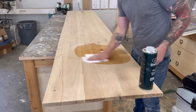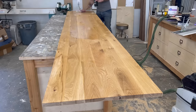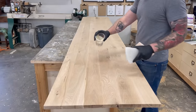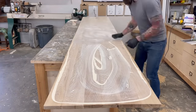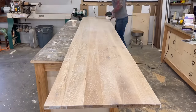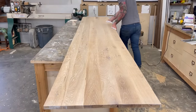With our desktop now cut to the right shape, it was almost time to finish it. First we cleaned off the entire desktop to get rid of any excess dust — Rubio Monocoat does a lot better when you get rid of all the dust, as it allows the finish to stick to the wood. With it all cleaned and dry I started pouring on the finish. I used cotton white — you can't really blame me, cotton white looks so good on white oak. Once you wipe it off it almost looks like you didn't do anything to it, which is just the way I like it. White oak's beautiful enough as it is, you don't need to mess it up with some weird color.